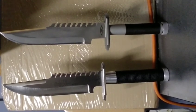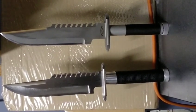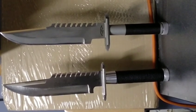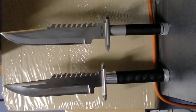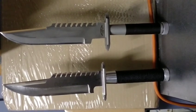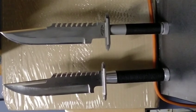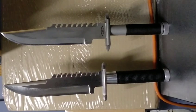The reason I went water jet and not laser cut is because my steel billets arrived heat treated. There's a hardness rating called HRC, and mine are HRC 59 — I've had them tested. I still remember the first time I tried to drill this stuff: I marked out a part, hit it with a center punch, and nothing happened. I looked at the center punch and it was completely flat — no point. When it's harder than the tool steel of a center punch, that's hard.